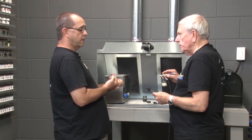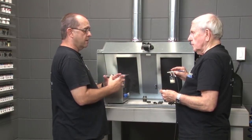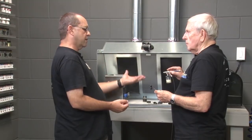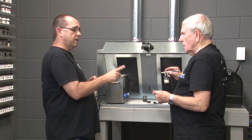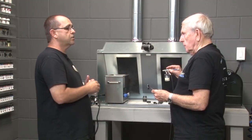Very good. Now we're going to go ahead and put on our satin coat. Now, it's the same type of mixture, but with a satin lacquer finish, right? And so, as we said, it's 2/3 to 1/3. 1/3 of the lacquer itself, and then 2/3 lacquer thinner. That's right. Okay. The one thing we wanted to mention when spraying this, though, is that you've turned it down a bit. I call it putting it on dry. Putting it on dry. Okay.